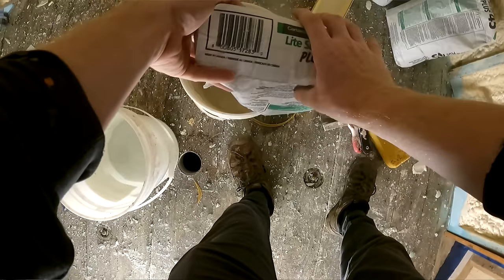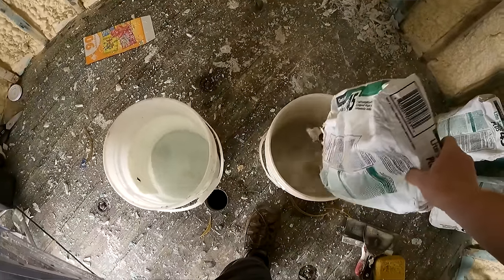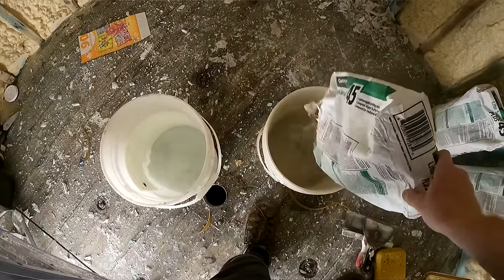Then I bent it around the perimeter of that underside ledge and screwed it in with some drywall screws. Then I doubled that up, because anytime you're making a curve, it's always a good idea to add two layers of anything, because it kind of averages out the curves. It makes it so you don't have any flat spots, because the one thing that sticks out like a sore thumb on a curve is flat spots. So you want to avoid that anytime you're doing a curve.